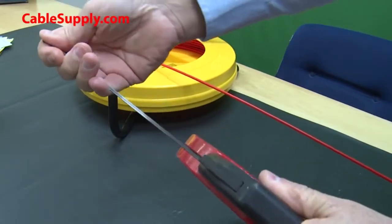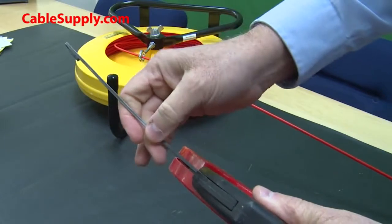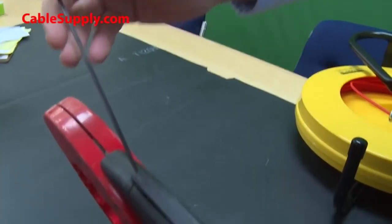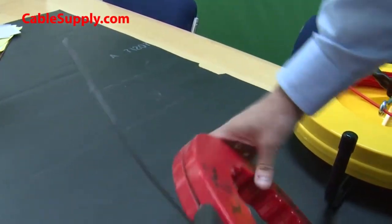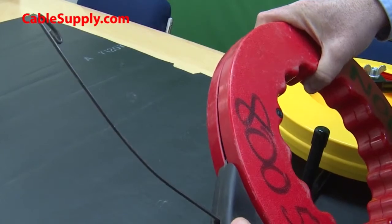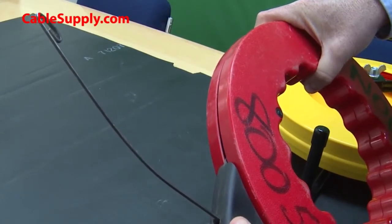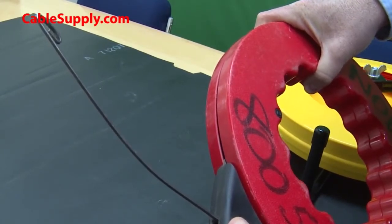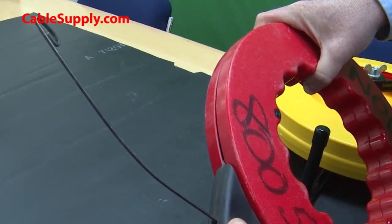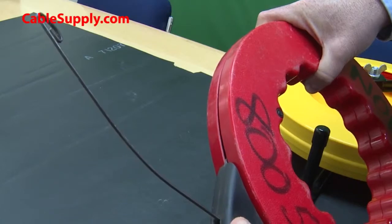It just won't bend. If it bends sideways, you're going to have a permanent bend in here and it will not straighten out. You can't push it through. And what will happen is you'll spend a lot of time fooling around with this fish tape when you get into those situations where you need superior fish tape. You'll be fooling around with this, trying to fish through conduit, and you'll hit one or two elbows, and then you can't get that third one because it's on a different angle.